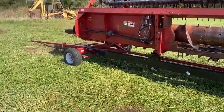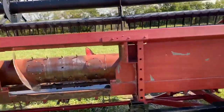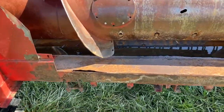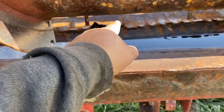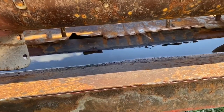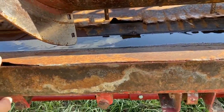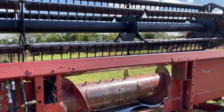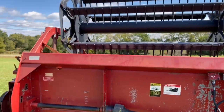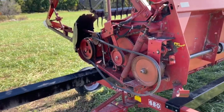I also picked up a nice little header trailer. This bean head still has a little bit of work that needs to be done on it. I've got some new shields I'm going to be putting on — up there and right here on this back plate — there's a liner kit that goes in there that I've already got. I've already replaced most of the teeth and a lot of the tines, although there's still some more that are going to have to get replaced.